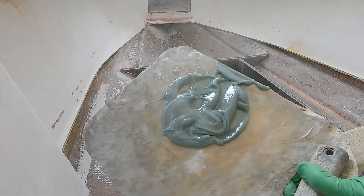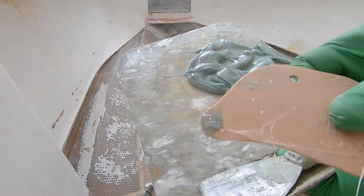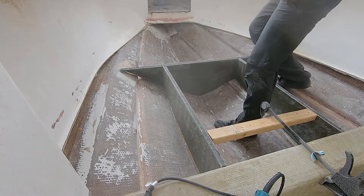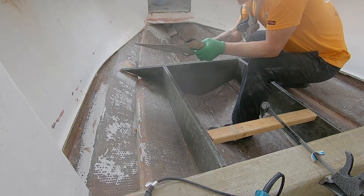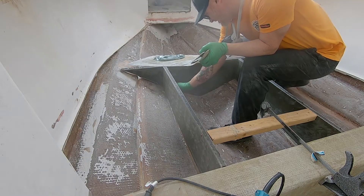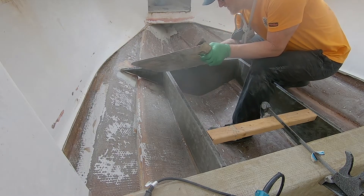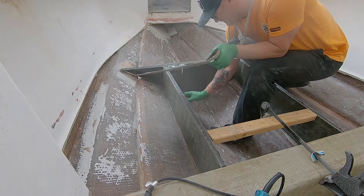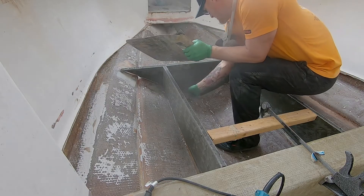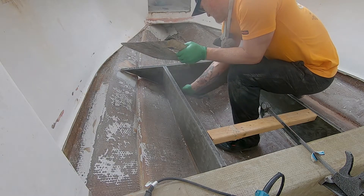Once we have all those voids filled in, the next step is adding a radius to the base of the stringers. I'm using a radius compound — more or less just a resin filler meant for doing radiuses. The good thing with this material is it stays tacky for a really long time, not more than a couple hours, but it will still feel tacky the next day. I wouldn't let it sit more than six to twelve hours before it needs to be sanded. You want to try to do all of this in the same day — you don't want to put some poly down and then come back and put more poly over it because you'd just have to sand and prep more between steps.